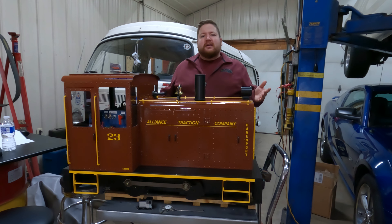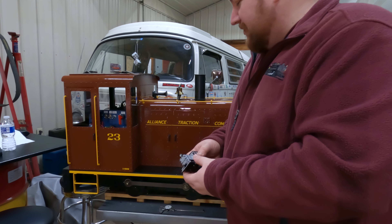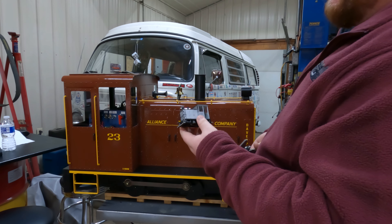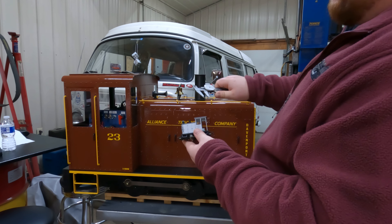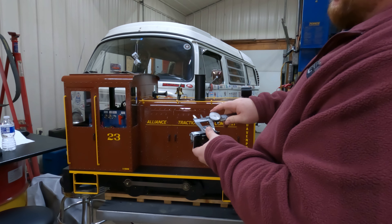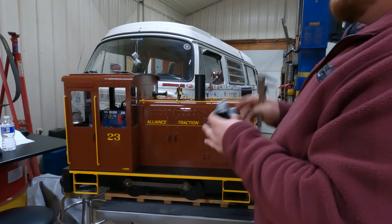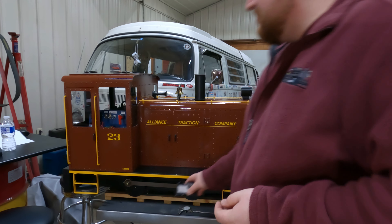I don't have a whole lot of video of the construction, but let's talk through it. To build the body, I laid this all out in AutoCAD, which is a drafting software. I believe Tinkercad is an online version you can find. I have an ON-30 model of a 30-ton Davenport that I scaled this entire locomotive off of — my frame happens to be about the same size. Using a set of calipers, I was able to start taking measurements such as the depth of the cab, how tall the roof is, the arch, and the taper across the top of the roof. I put that into AutoCAD to make sure all my proportions were correct rather than going freehand, drilling holes and cutting sheet metal in the body panels.